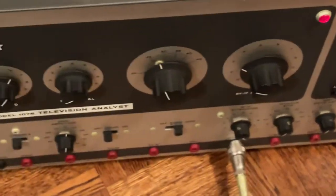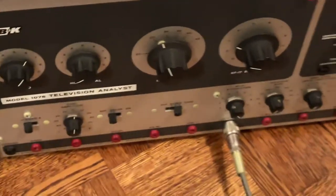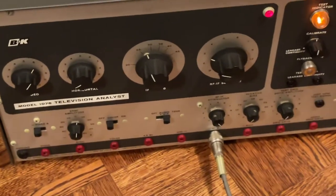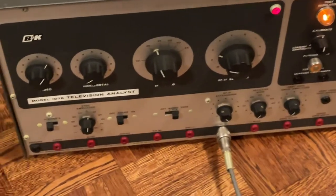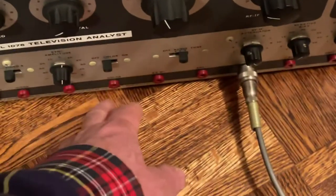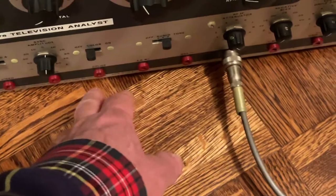This device is not only a miniature TV transmitter, but it also serves as a test setup for troubleshooting analog television sets. It provides sync and baseband composite video, and a 3.58 MHz color burst for testing color television receivers from the early 1960s.